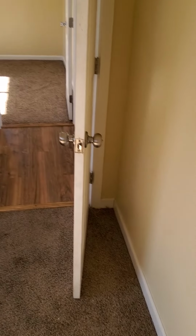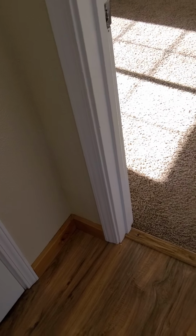So that is the, and show a couple things, readjust striker plates. And there's also a warped door. This is a warped door right here. Let me see if you can see it. It's hard to show on the video, but this door should get replaced. It's a hollow core warped door. Happens a lot when the painters lean their doors, and then they have that be the bottom one.